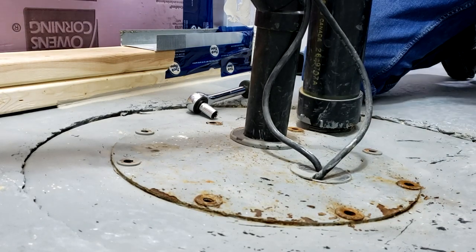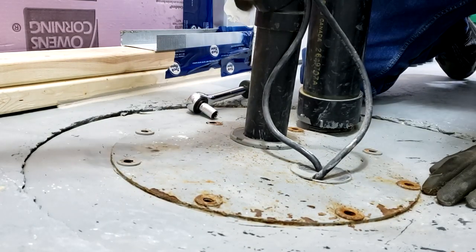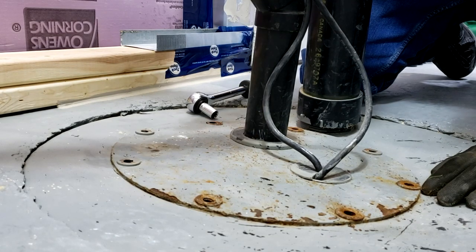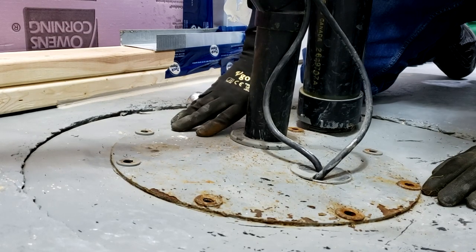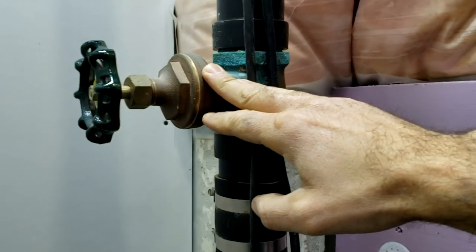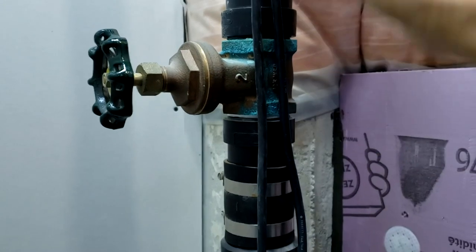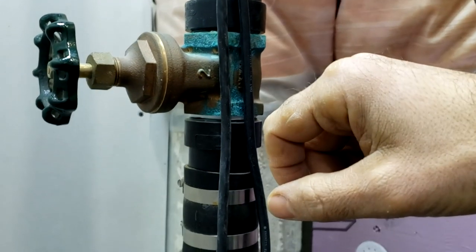Make sure to set the bolts aside. We're going to need to separate this two inch line — this is part of the reason we shut off the main valve above, to prevent any standing water from falling back into the sewage pit. By code, a sewage ejector requires a valve at the downstream side of the check valve. This is to ensure that when the sewage ejector is being serviced, no existing nasty stuff ends up falling down unintentionally toward the user and causing havoc in the building.